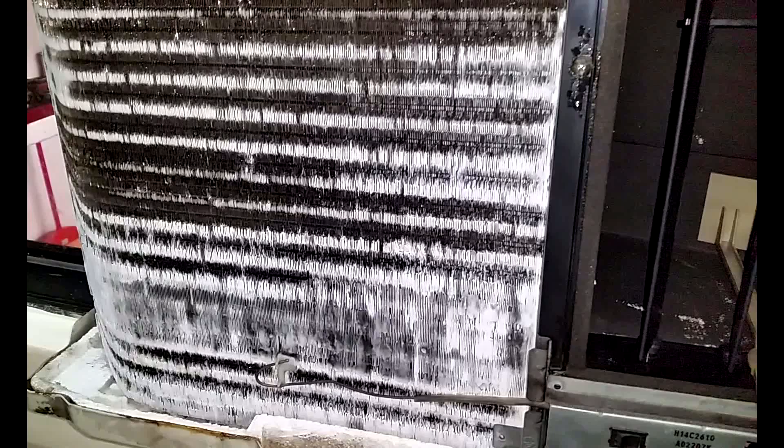If you are not familiar with doing these things, it is better to call a professional to do the service. The third thing to check is the airflow — check whether air is passing through the evaporator coil and at what speed. If airflow is low, that may be a reason for ice building on the evaporator coil. In my case there was a problem with a malfunctioning blower capacitor, which I replaced to restore full airflow speed.